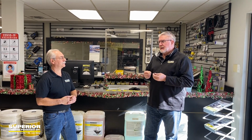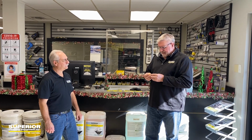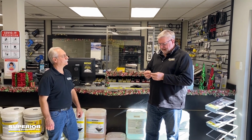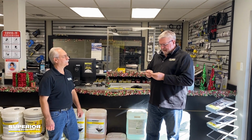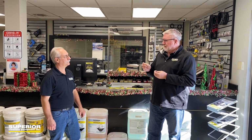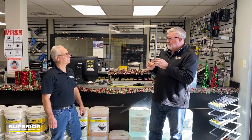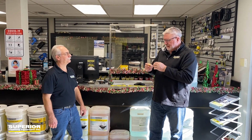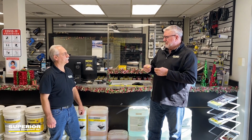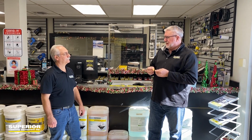The other thing that we haven't talked about, but is also important, is that I was in the contract cleaning business for about 6 years before I came into this business and bought the dealership here about 30 years ago. I was always surprised by the fact that a worn nozzle, because you're pushing water through the size of a pinhole, and over time you are widening it. Wears out, yeah. So you can pick up 300, 400, 500 PSI. If you've got a 6-month or a year-old nozzle that you've never changed, you put a new nozzle in there, you can pick up some PSI, right?